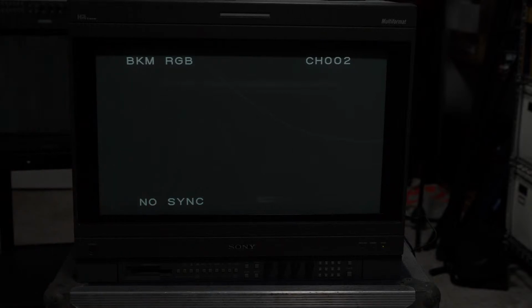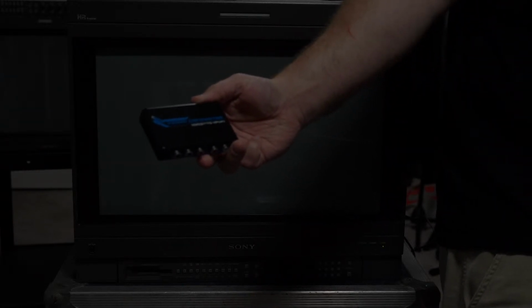Well, I got one other very quick thing to try, just because we're here. It's only going to take 1 second. Perfect, found it. It's a little dim here, but this is an HDMI to component video converter. So it should be able to handle 720p no problem, as well as not have that sync curl issue. So we'll see how that works out in a second here.